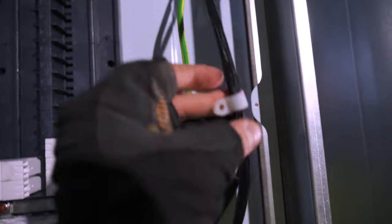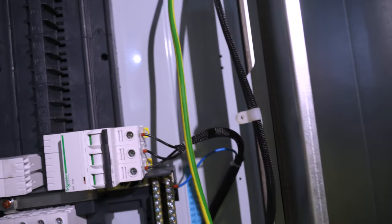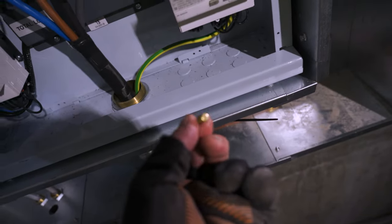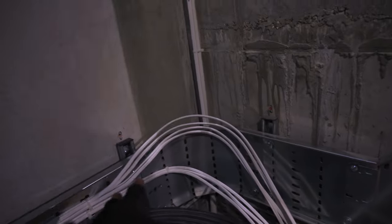I'm going to get this just pinned back. If you didn't know, this comes like that. I think it does normally come with fixings, but this time it hasn't. So we'll actually take these brass M4s and they will easily fit into these — they are actually 4mm threaded. I'm going to get these cables tidied up, and then I think I'm going to get all these armoured glanded in below here. I can't do the T&Es because you need another bit of tray, another bit of trunking, stuff like that.